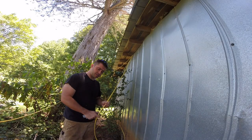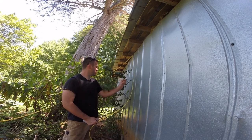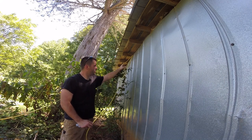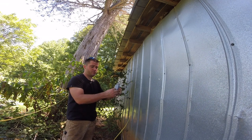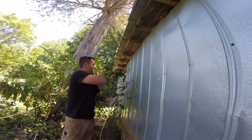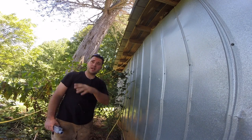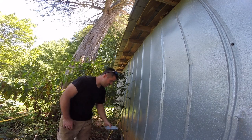Last night I hooked this wire up to the breaker box. This wire's coming out of there. Now I'm going to put it inside conduit all the way up to that point. I'll have a 90 in it so it feeds in. The pipe will come down to a box just like this right here with a removable lid, and that's where I'll put a splice in it. I will connect it into the current wire that's running out to the tiny house. But I want to disconnect the tiny house at the last minute because it's going to be unplugged for a couple hours and I don't want my ice cream to melt.